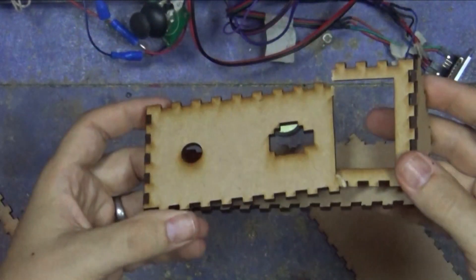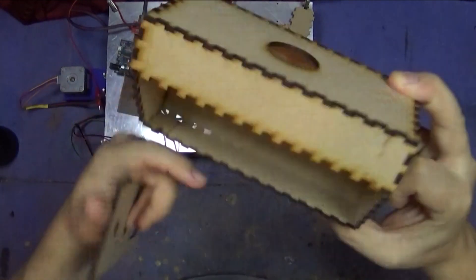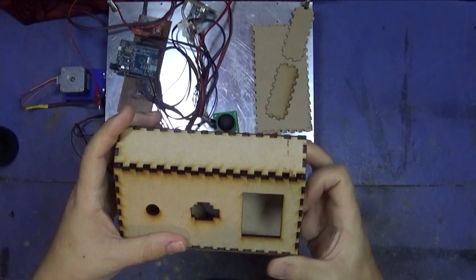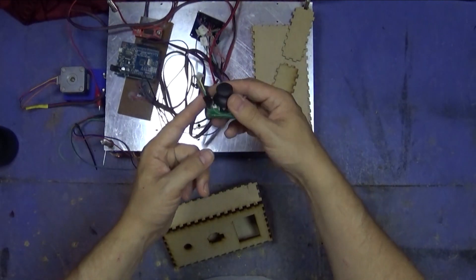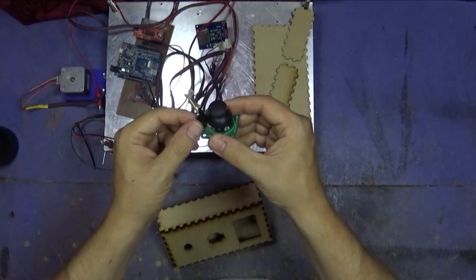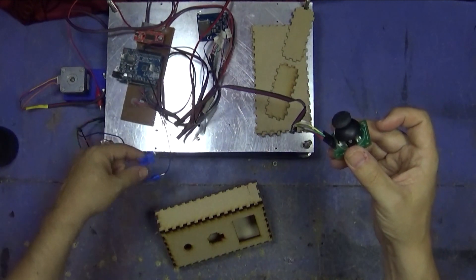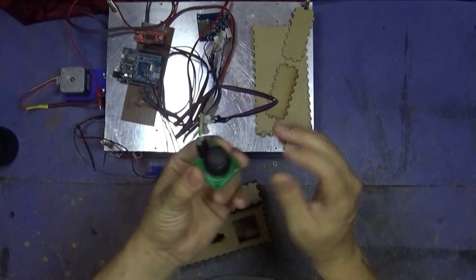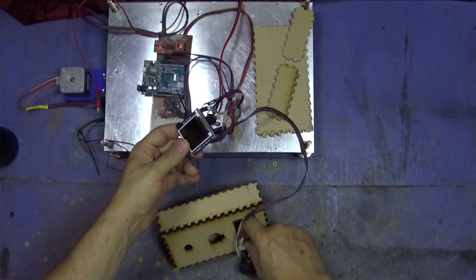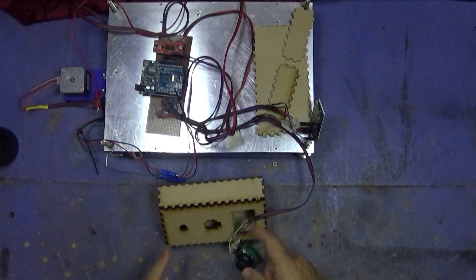Right, that didn't go well — the assembly definitely didn't happen cleanly. I also made a few mistakes: there are unintended holes on the bottom and top. Next, I want to desolder the joints on the joystick and solder them onto the back, using these connectors again so it's plug-and-play. I could solder directly, but connectors make it easier to move around. I also need to work out where the solder joints are and file out a bit so it comes up flush, and then install the switch.